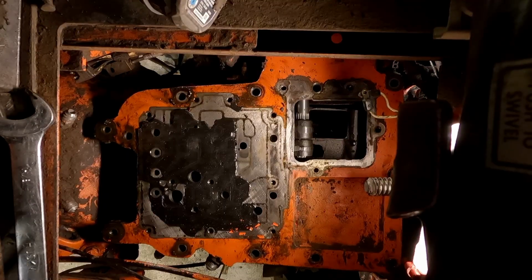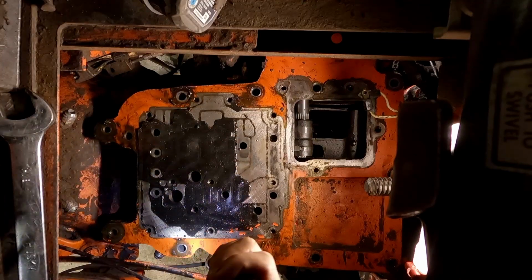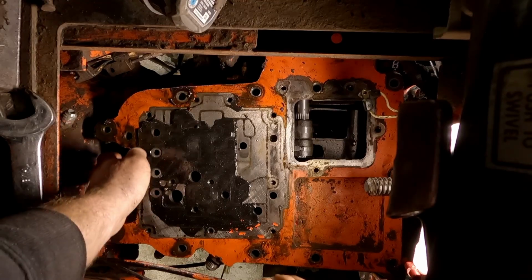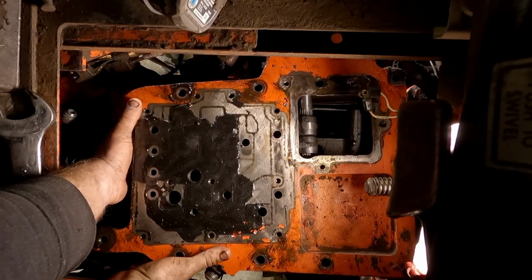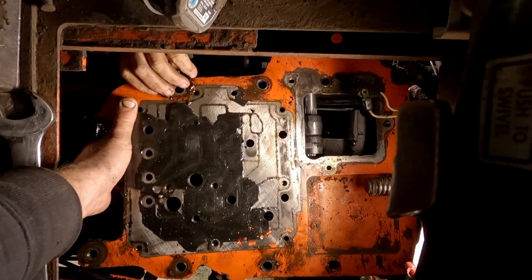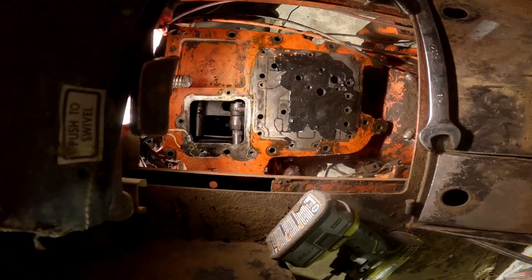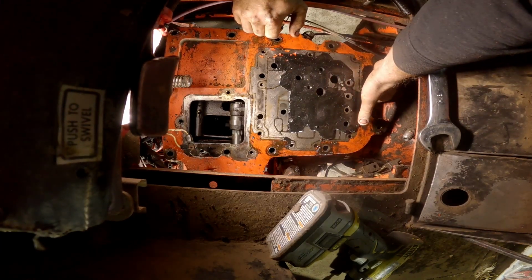We have to pull the alignment pin out. So this pin we have to drive out, and this whole shaft will slide out that way. Can we shift that plate over this way so I can drive that pin up through? Maybe, if we clear the transmission housing right here a little bit. That oil tube over there is going to be a pain. It's going to be in the way. I can get my finger there, but I can't do anything other than that. If I go from underneath, if I can lift this up and you get from this side to that oil tube. Reach across, you're saying, from over here? Yeah.